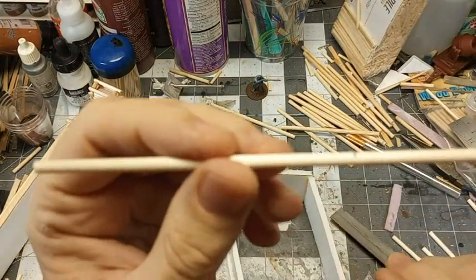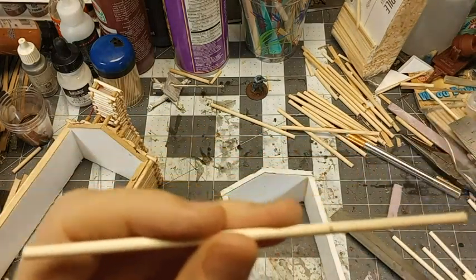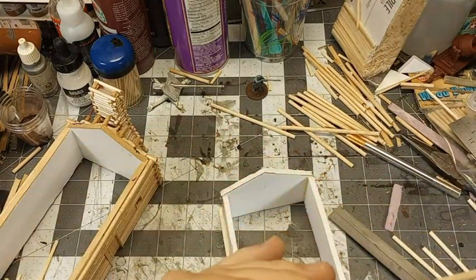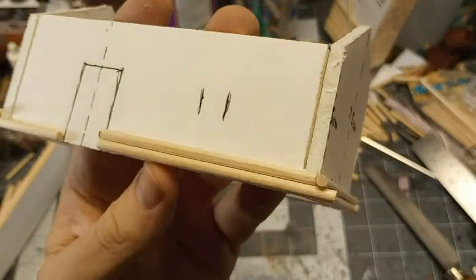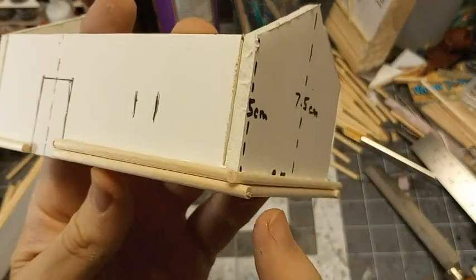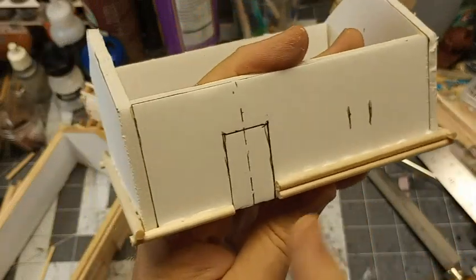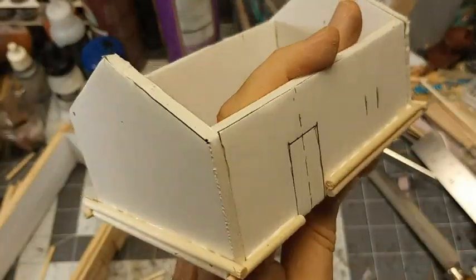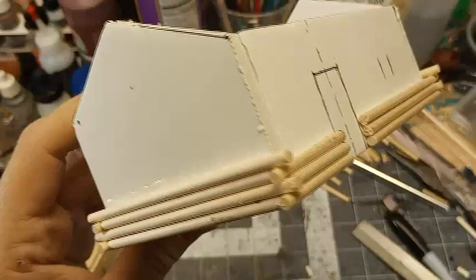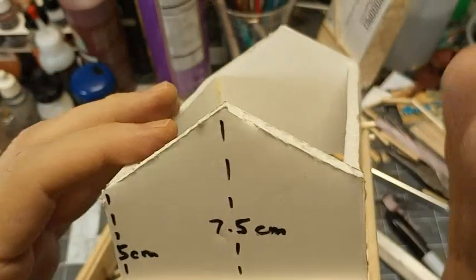One of the things you can do to speed the process up is, as you figure out your dimensions, go through and start cutting pieces to fit in between or as a next course, get a bunch of those done, and then you can just assemble — it's much, much faster. Another thing that speeds things along: in this case it was a happy accident — the filler pieces on this side are the same length as the filler pieces between the door and that edge of the wall. If you can do things like that, you will greatly speed up your build process. Also, save your offcuts, because even the little short ones we're going to use. We're just going to continue doing that around the building and building it up.